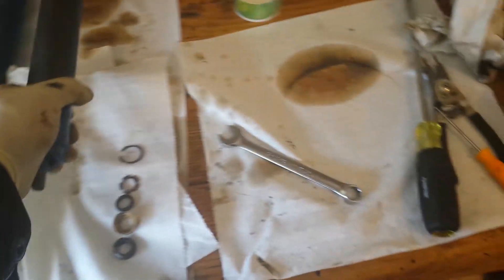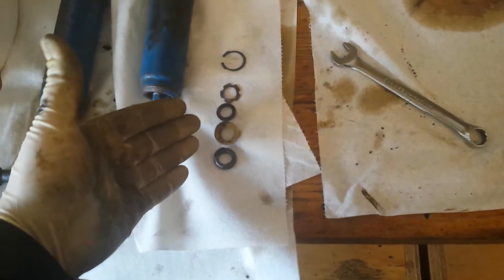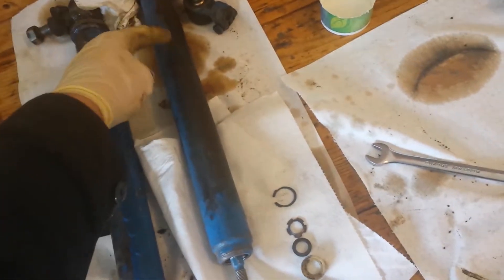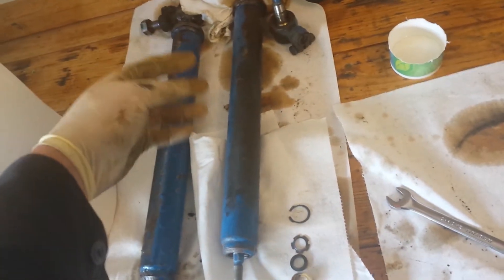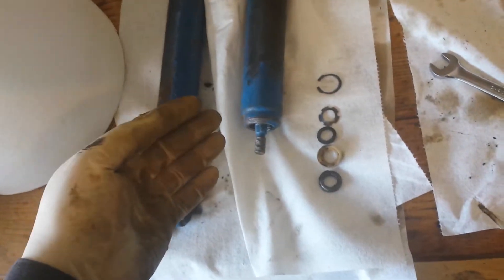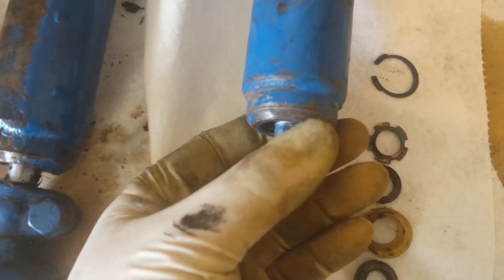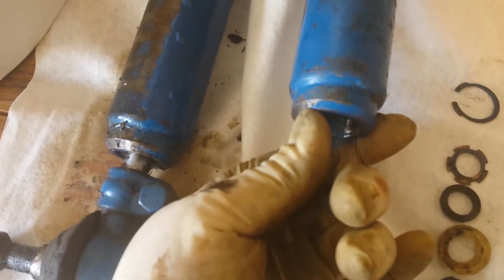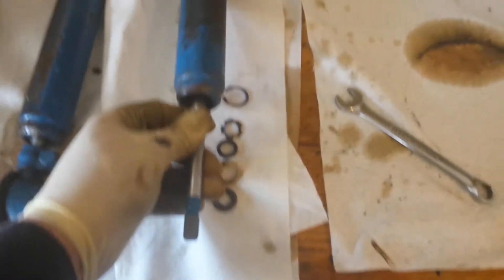I got the cylinders apart and it's not what I was expecting. I was expecting a full rebuild kit to totally rebuild the ram assembly — the end seals which is right here, and then the piston inside. It has the scraper ring and the pressure ring on the piston, so I was expecting to be able to take the whole thing apart, but it's not like that on these. It appears that when it's assembled, this edge right here — I don't know if it's welded or pressed in or what — but it acts as a stop for the piston so it won't come all the way out. It's pretty much a dead end right there.